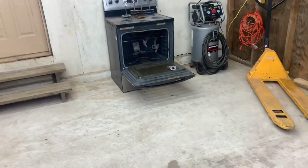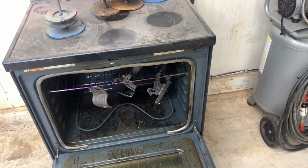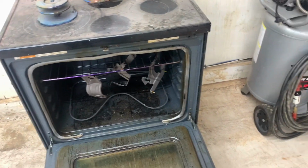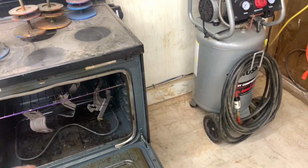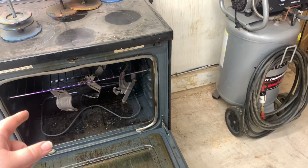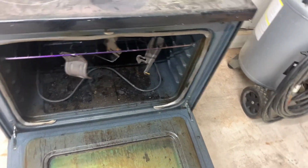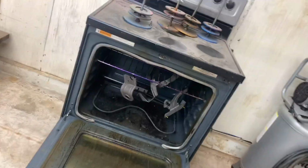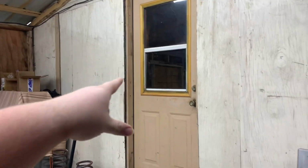Now, all of my little bracketry stuff we're hanging in here. We're just gonna use this oven. There's no reason to heat that thing up for these little pieces. That's kind of where I'm at. So I got the threads taped, you can see there, on all of the exposed threads for the holes with threads in them. One of these, that one in the back there, had some of those insert threads. I have powder coat plugs in there that will stick in those, and we'll be good to go.